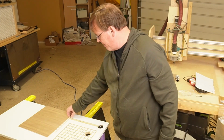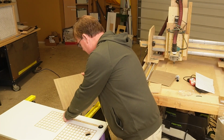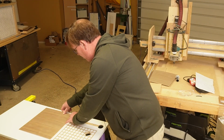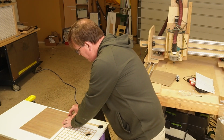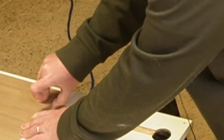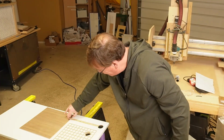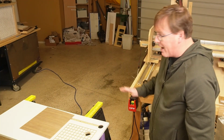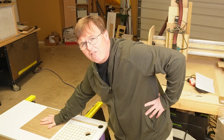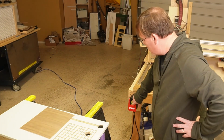What's the problem? The answer is you need to take that strapping tape, and as I wrap it over itself, you need to have that board over the end, and you need to push it on the surface of your other board, and then take your fingernail and rub it along the edge so it gets a tight seal so that channel is sealed off good. And then we're going to turn on our vacuum, and we need to push down on the surface of the board until the vacuum catches. If you listen with your ear, you can tell when you've got it going. So let's test this.